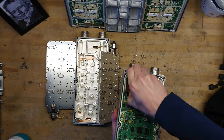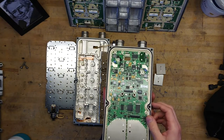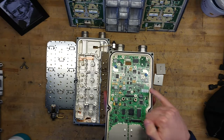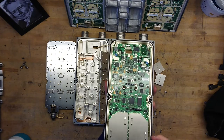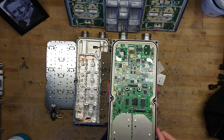That's actually a power supply — power supply and perhaps transient protection. All the noisy magnetics have been put underneath a small Faraday cage in order to minimize the amount of noise being spread through the amplifier.